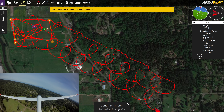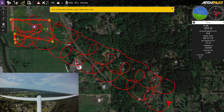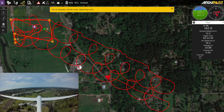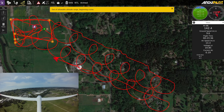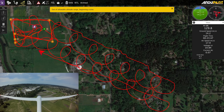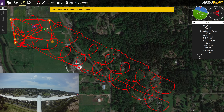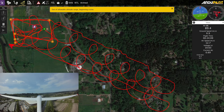I'm getting pretty far away now, so I'm going to throw it back into return to launch mode. It's getting pretty far away and my battery voltage is way too low. Since I'm flying into the wind to get home, I really need to take this out into the desert or somewhere more wide open and see how much altitude I can gain from thermals. Luckily I think it's not really using much power for motoring home, because it's climbing and the current is near zero — which means it's finding lift on the way home, going through thermals. There's probably just so many thermals today since it's spring and a nice day with not a lot of wind. But okay, the plane is here and I'm going to go ahead and land it.